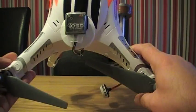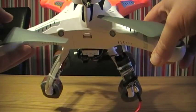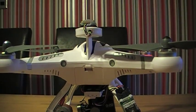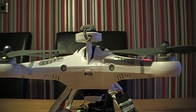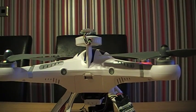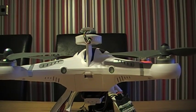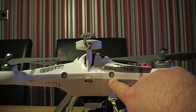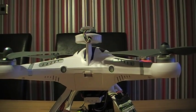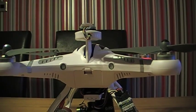Round about £30, that sort of figure. What I've done there is, if you can just see, I've taken the wiring loom through the back of the existing turret which houses the GPS module. Now by doing that, all that's really happened is it takes a little bit longer to gain the GPS signal onto the Quattro, so I have to wait a little bit longer for my green light to go solid. But once it's locked, it's pretty stable. I haven't had any problems with that whatsoever, so so far, so good with that.